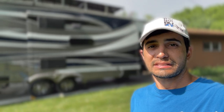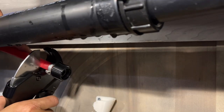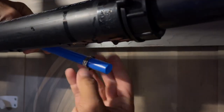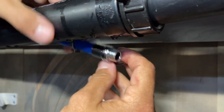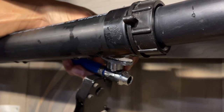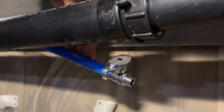Now we're ready to connect the new lines to the existing PEX piping. We'll use PVC cutters to make a nice clean cut on the existing PEX pipe, get rid of the old female threaded piece — about three-quarter inch — and replace it with a PEX-to-angle-stop valve fitting from Home Depot. We put a new PEX crimp ring on the cold line, press in the angle stop valve, and crimp it. Then we do the same for the hot line.